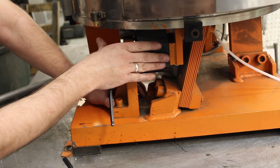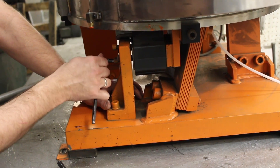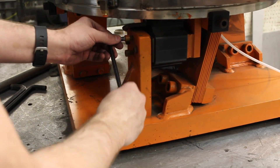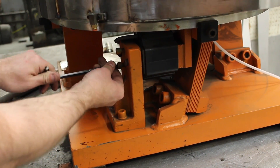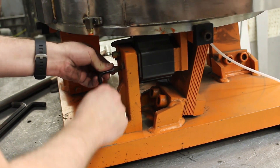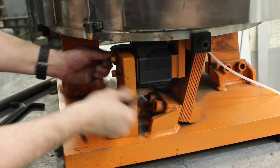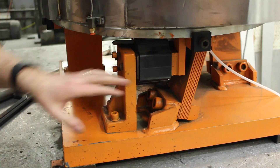What we're going to talk about now is the coil gap. Typically, these two bolts in the center are going to be the bolts that loosen you up. You can just kind of break those loose — they're not going to be too tight most of the time. Those are the ones that tighten the coil and pull it. So when you loosen those up, that's going to give you some gap here, giving yourself a little bit of room. You'll feel that coil — see how it's kind of loose now? That's about as loose as you want to get it.